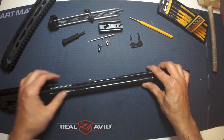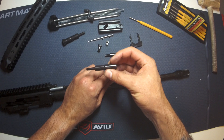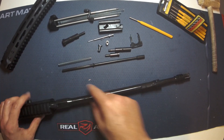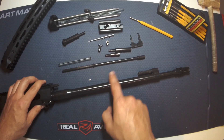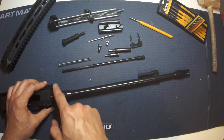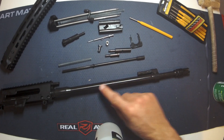To get this apart, we're going to grab the piston, pull it backwards, pull out the extension, pull out the piston cup, and out comes the operating rod and its spring. That's all pretty simple - it's a fairly simple system, fairly reliable by all accounts. Most contemporary weapons are moving to this kind of piston system anyway. It's not that the AR-15 is outdated - it's just a different system. It still works, still does the job. But I want a piston. What I want to do is get all this factory grease off because it's more preservative than lubricant.